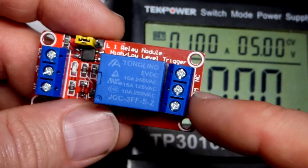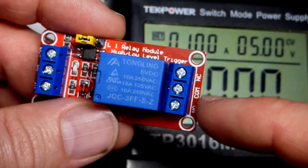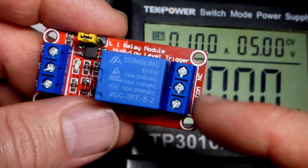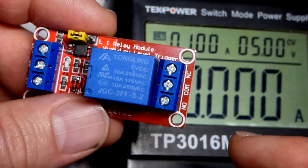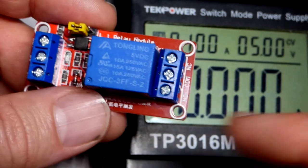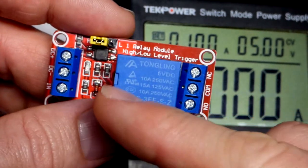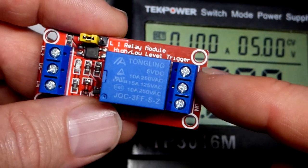When that's not normal — you're giving the coil energy — it moves the switch to the normally open position. Then these two points will be connected. You've got a wire going to one and a wire coming out of the other one. Electricity can flow through it in either direction between those two points. Then you de-energize the coil, cut power, and it will switch back.